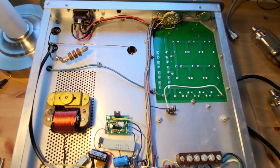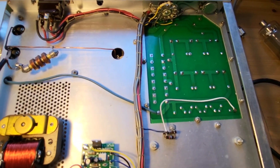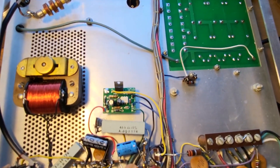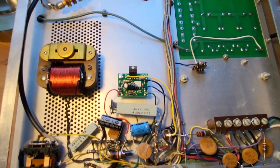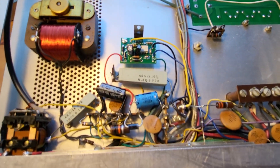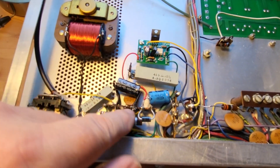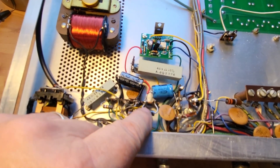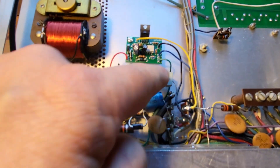Here's the bottom of the amp. This particular one had a new power supply board put in when I got it. I don't know why they didn't put a soft key or soft start in there, but I took it upon myself to try this. I'm a very unskilled person — don't look too close at the soldering — but it's in there and I believe it's working. The last two connections were the red wire, which goes to the second lug — the negative end of the capacitor and the end of the diode — and then the green wire.